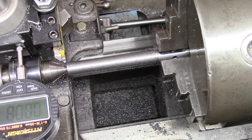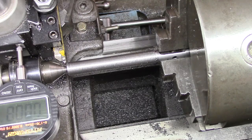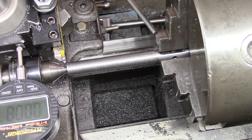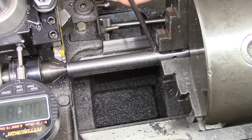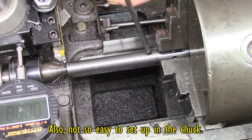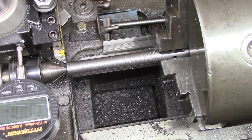I was just going to point out the first one I saved two and a half inches so I could chuck it the other way around. What I've done here is extend the fork end spare and I cut a relief here, which is desperately close to the chuck. So I've really got to watch disengaging my half nuts.